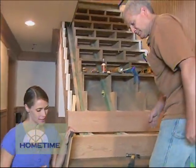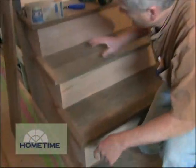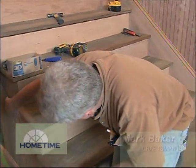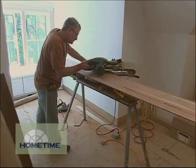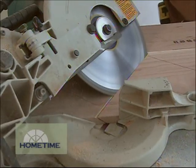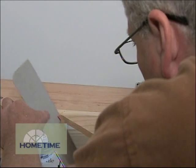So we want to talk about a couple of details with these steps. First would be the skirt board flare — how exactly did you get that to happen? We had to fur the wall out from nothing to about three inches here to give it a nice gentle curve without overdoing it. Then we built up the wainscoting over that, bent the base around, and set the skirt board up. We marked out all the treads and risers, took them upstairs and cut them on the miter box to get a nice crisp miter, then cut the tread part with a jigsaw and finished it with a handsaw.